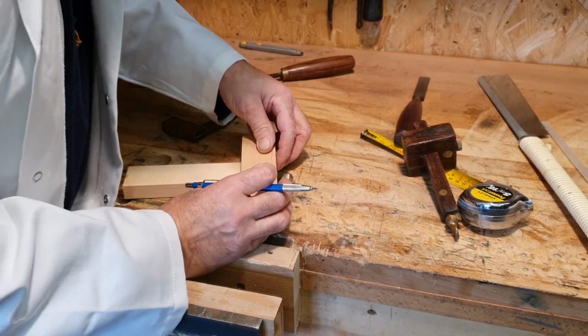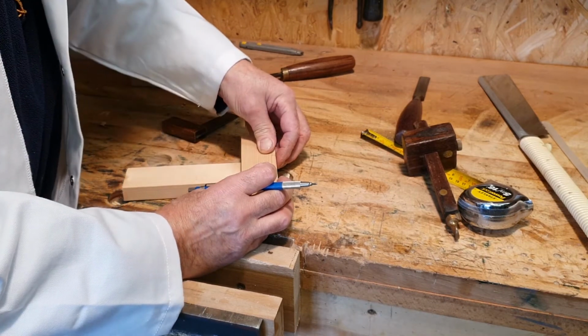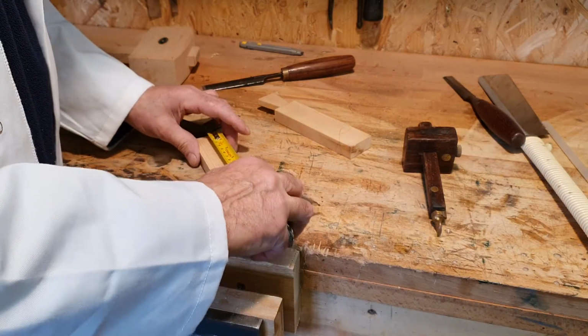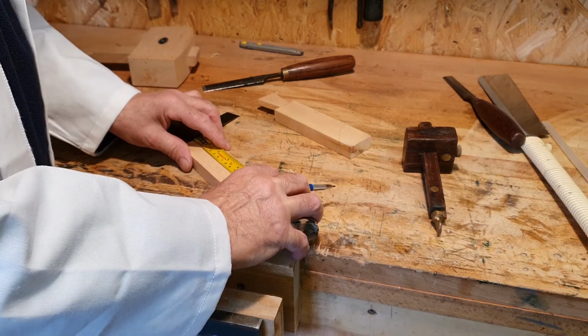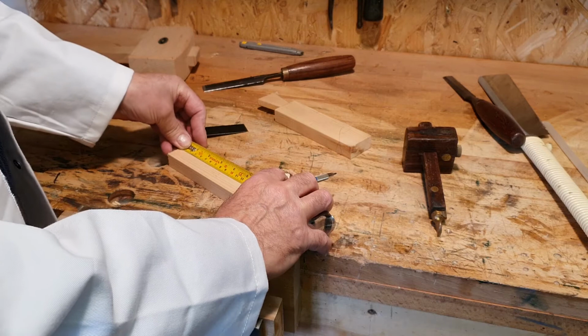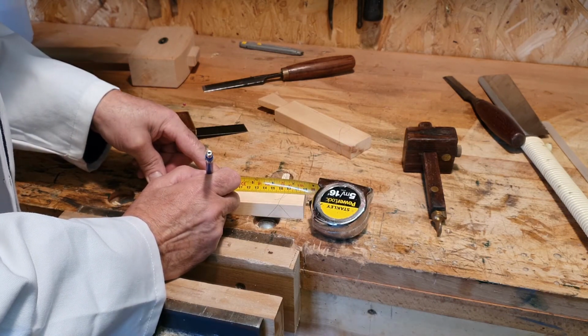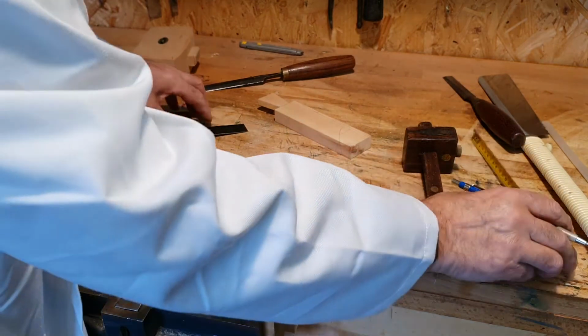Place the dovetail workpiece across the end of the other workpiece on the face side and make a mark. Measure the longest length and divide by 2. Then measure the resulting dimension from one end and make a mark. Place the dovetail workpiece against the mark and mark on the other side for the width of the dovetail workpiece.